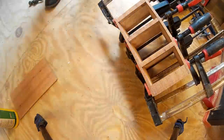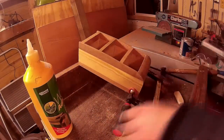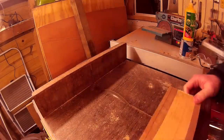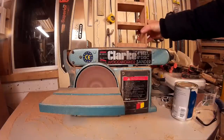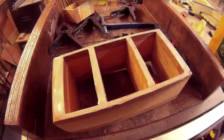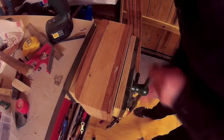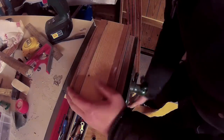Then I waited for the glue to dry. I could then trim off the overhang on the crosscut sled on my table saw and then sand the bottom of the carcass flush. Then it was time to glue the rear panel back onto the carcass, so I glued that on and used my vise to clamp it. And I slotted in a wedge of wood cut on the table saw to compensate for the curved front so that the pressure would be evenly applied.